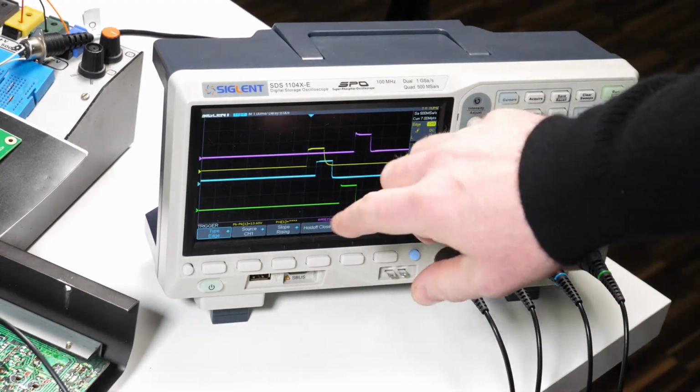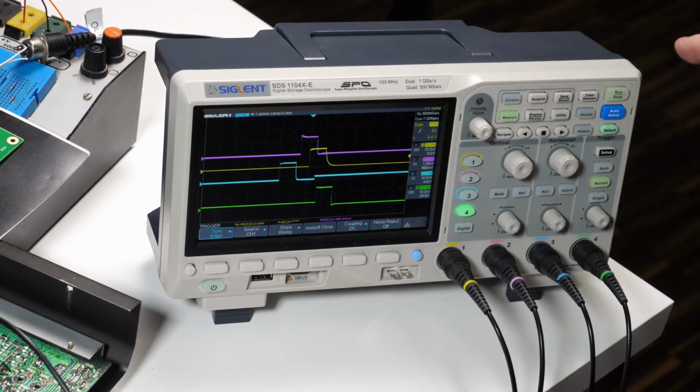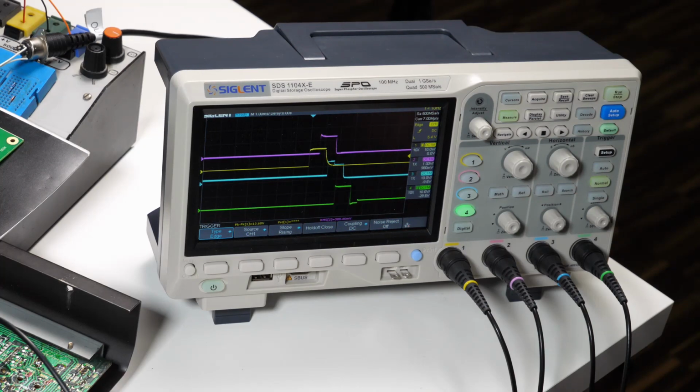But running with MIDI, the sounds vary on each step, because depending on the order that those notes are sent by the MIDI sequencer, each of the different sounds might start at a very slightly different time, but that's enough for the sounds to interact with the oscillator waves. You know, they'll interact with each other differently depending on the very precise timing of when those things start.